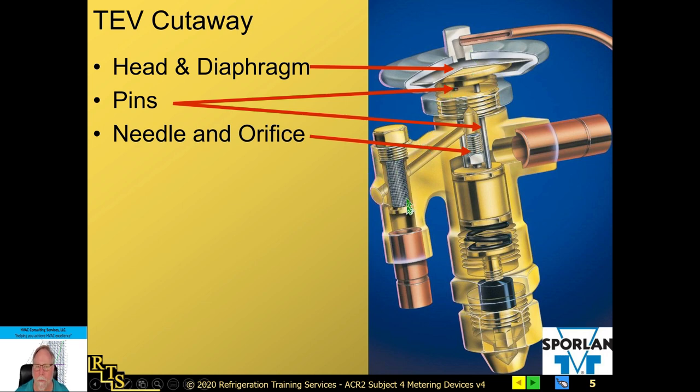On this particular valve, the liquid line comes in parallel with the expansion valve body. It has a little cap on top with a screen that helps keep the expansion valve from clogging up. However, be sure you remove all the refrigerant from the system before you take that plug out, because if you don't you'll have a fountain of refrigerant flowing out. Your fingers don't like it, your skin doesn't like it, and the EPA doesn't like it either.